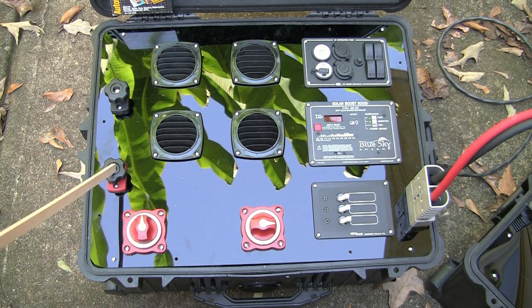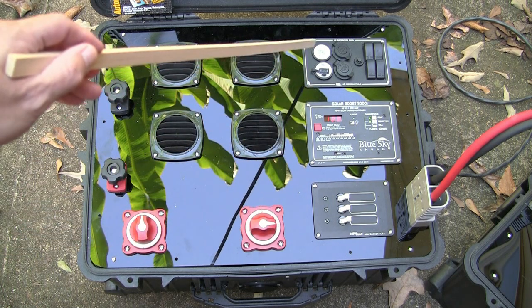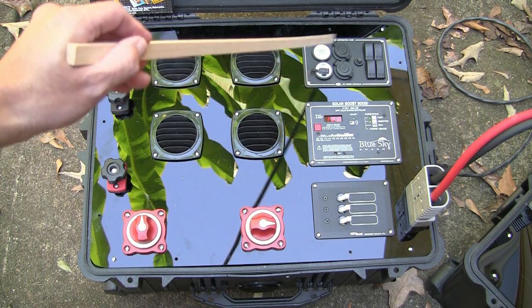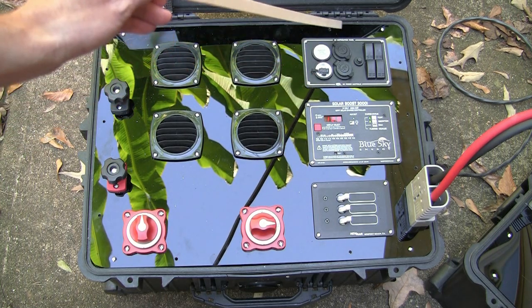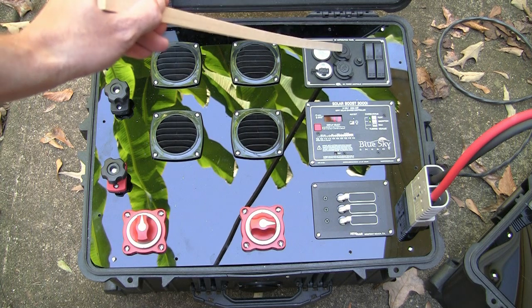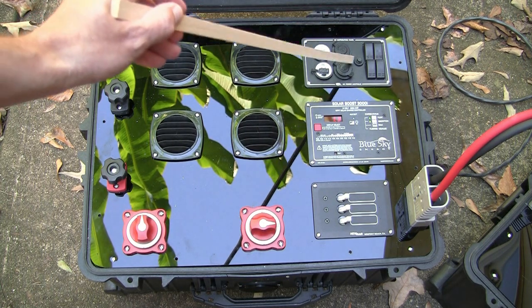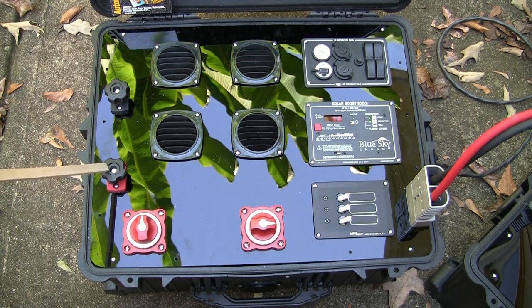And then over on this side I have 2 battery terminals, and the reason why is when you're talking about car battery voltage and these little distribution panels up here, most of these are only rated for like 15 amps. You can't take an inverter that's more than 180 watts and plug it in here. You risk overdrawing and blowing the fuse. So that's why there's a couple extra terminals over on this side.